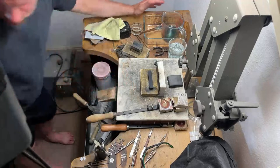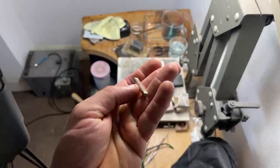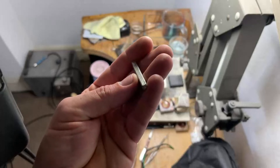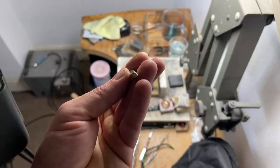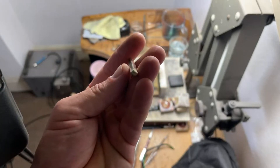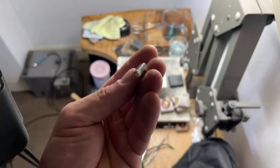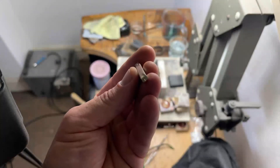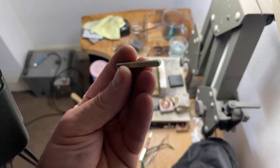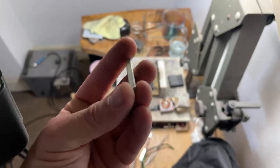Obviously it's not the only project I've got on the go — I'll give you a close up of this. It's starting to take shape now, you can see it's taking on a square with octagonal edges that the rolling mill sort of creates. It's actually started transitioning — probably the first one or two passes were really just reshaping the metal to that octagonal shape. Not a great deal of serious reduction goes on — more reshaping than reduction. Now it's been a transition to being reshaped to actually reducing.